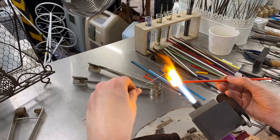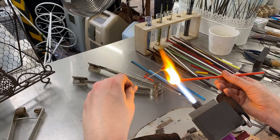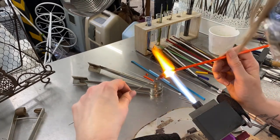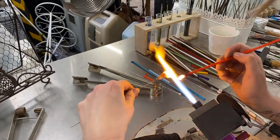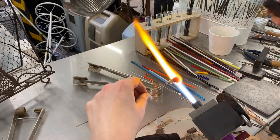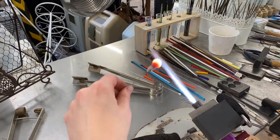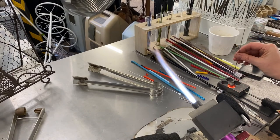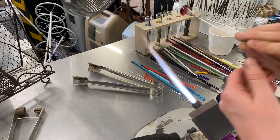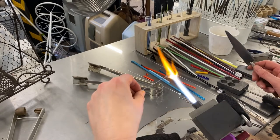As you can see, the gather is getting bigger on the carrot red glass. I'm angling the rod backwards on the diagonal so that as I form the gather, it falls back onto the rod. I think I've got enough now, so just flame-cutting off that rod and forming that blob. Just trying to keep the heat in the carrot red and round it off and centre as much as possible. Now using a graphite mould — actually a round bead mould — just to form the cap. Drop the glass straight down and you come out with quite a nice half-circle toadstool or mushroom cap on your stalk.